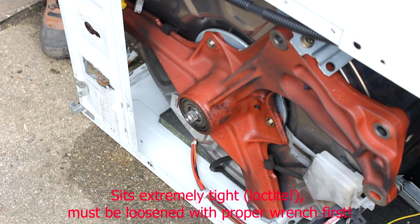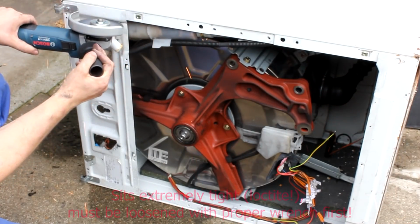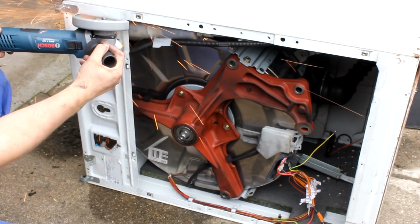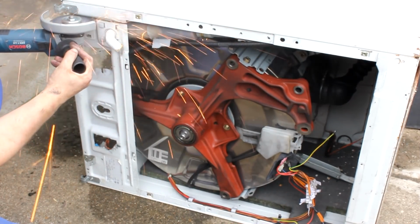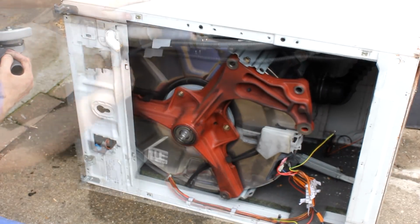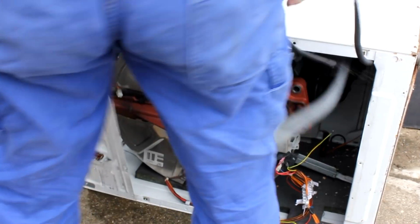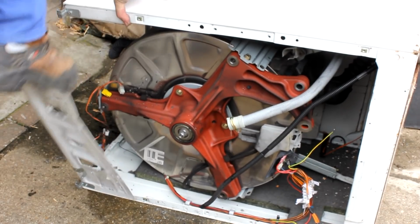And in order to do that, I now first remove this aluminum pulley because it's rather frail and I don't want it to be damaged or bent in any way while I pull out those heavy parts. And because I want to avoid having to lift this heavy assembly off the ground at any point, I prefer to cut the enclosure here and bend this piece of sheet metal over so that I can pull it all out the backside without having to lift it.